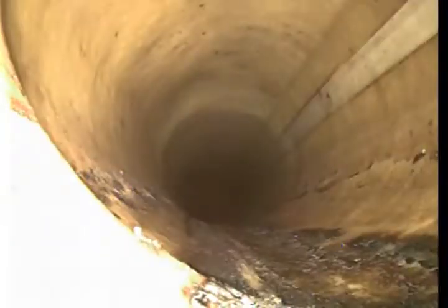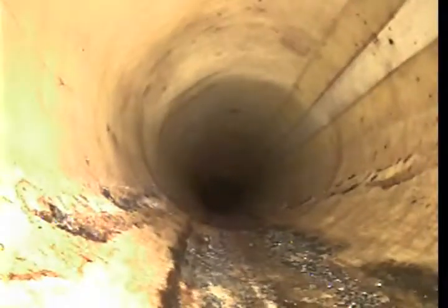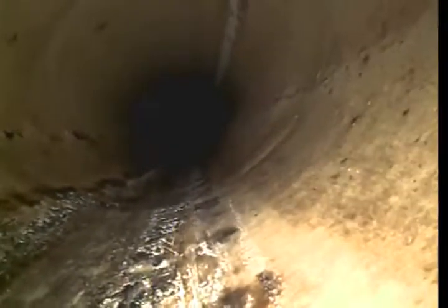Kind of difficult to tell because you're in a turn, but in the upper right hand corner you see a dark spot. Looks like maybe a little crack and a little tear in the liner, but it could just be stained as well. It's very difficult to tell because you're in a turn. There's no root intrusion. I don't see any problems, so it's not something that I'd be concerned about at this point in time. It gets dark just from, it's originally a white colored lining.